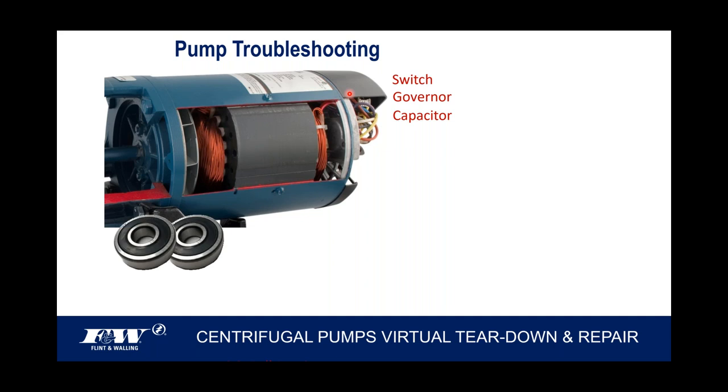Those are those two stainless steel ball bearings I mentioned earlier. Again, these are put on that rotor shaft within this distance of the motor from front to back here. That's the cooling fan. Copper stator windings. Our motors are dual voltage motors, meaning they can operate off either 115 or 220, either one. I'll show you in a minute how you change the voltage. That's very, very easy to do.